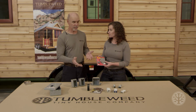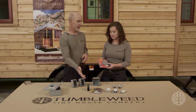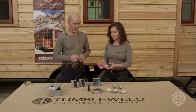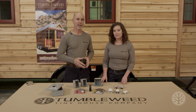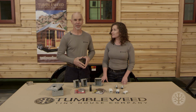Right, and that's two different purposes for those breakers. The arc fault would not protect you in a wet area, and the GFCI would not necessarily prevent a fire started from an arc. So know what to talk to your electrician about, know what the code is in your area. That will help you get the wiring job and the features that you want in your electricity.